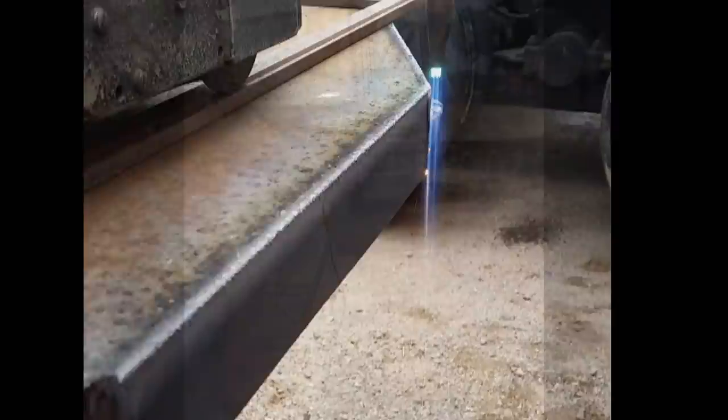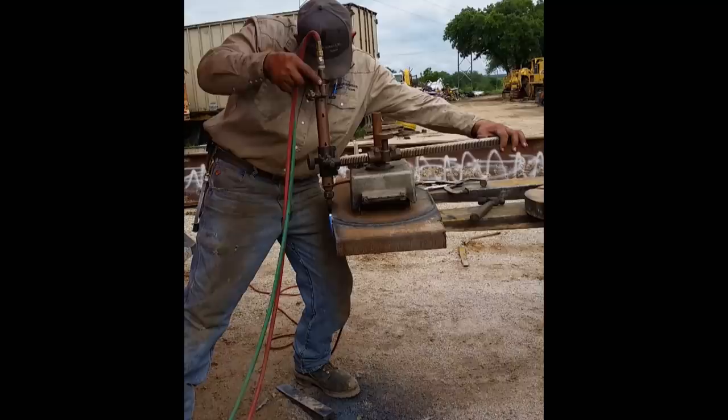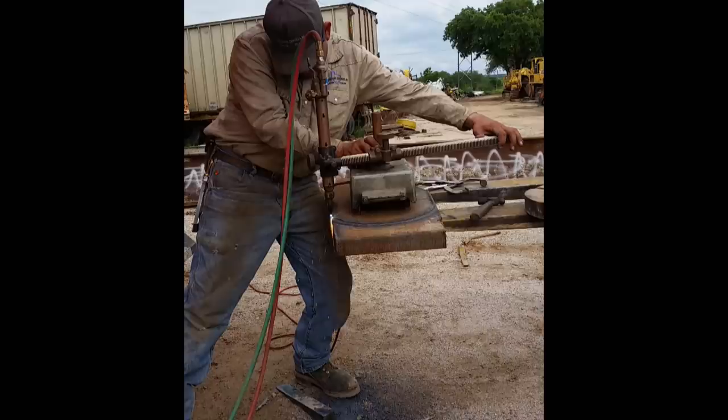Now this is part of a video that was in one of my older videos where I was piercing a 2-inch piece of plate. The reason I was able to pierce it so easily is because I had already made all these cuts to it, so the plate material was really hot.